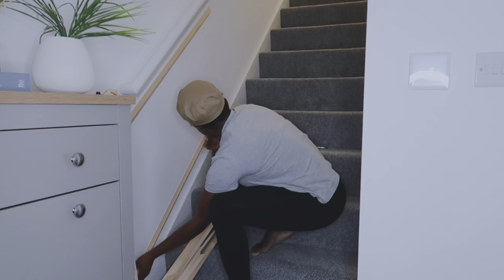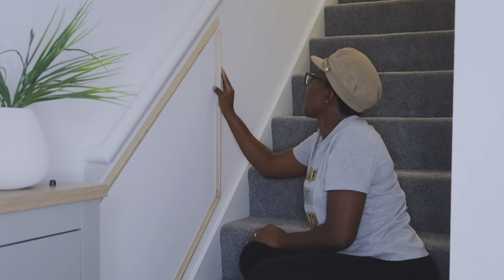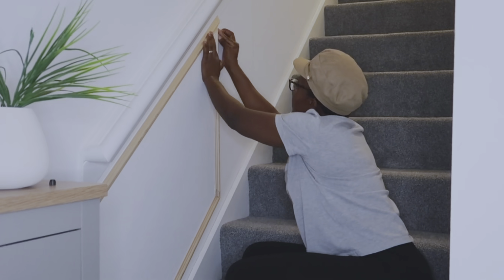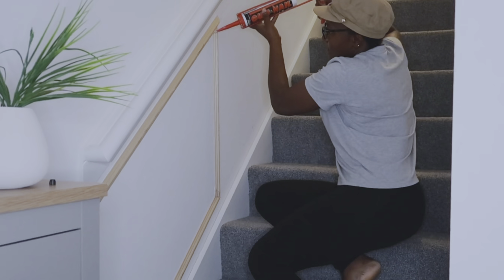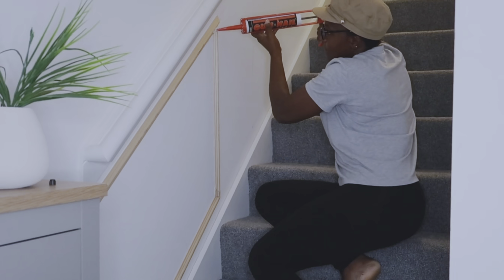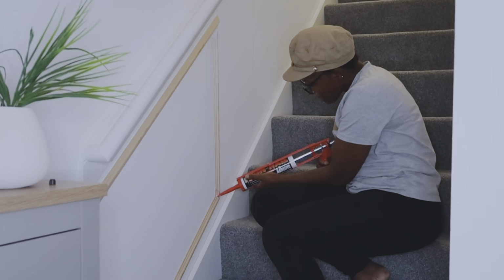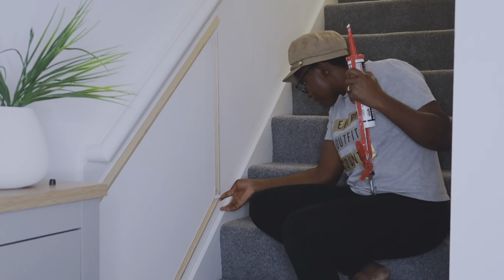So as I said, I'm putting all this on, I'm doing the first one, and when I was cutting my angles, there were some places where I made a little bit of mistakes, but you can always go over and rectify your mistakes. I even used sandpaper after all this work to sand it all down, and the place where I'm using the glue to fill in is a joint that was not properly joined. If you can see properly, it wasn't properly joined there because I did not cut it well. So when it dried, I sanded it to be very smooth to meet the wood at the other end, and the whole thing looked really better than I thought it would be.